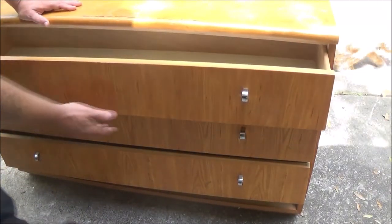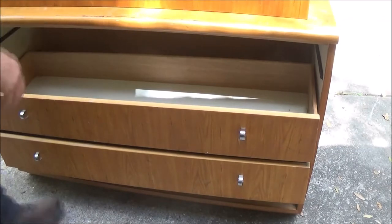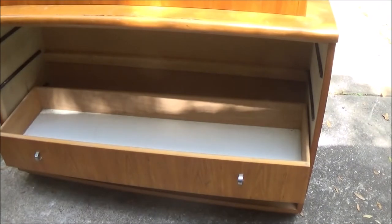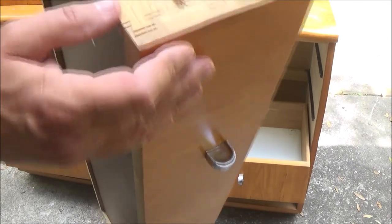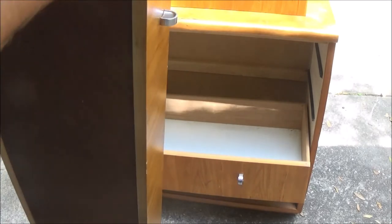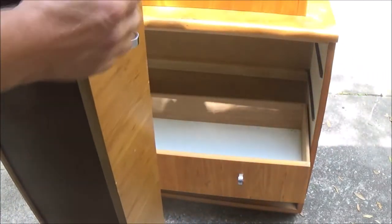It looks like it's in there crooked for one thing. It's always been like this since we've been together — I keep telling her I'm going to fix this someday. It looks like there is a drawer missing. I think what we can do is re-glue these. That's not a pencil mark I thought it was — I think it's just the way the wood is. Someone's tried to glue that in. You're not supposed to glue the bottoms in of these things, because it can't move with the heat and the cold.